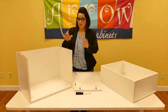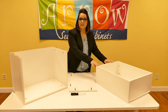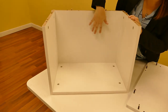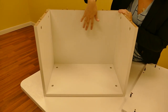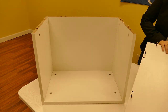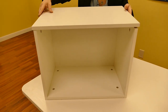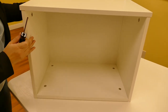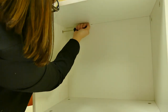In step 11 we are going to assemble the last of our drawers. Note that step 10 is the exact same drawer assembly, just with different panel names. Begin step 11 with the bottom drawer panel, attach the back panel, and connect the bolts to the side panels. Make sure that when attaching the bottom panel the smooth side is facing inward and the cams are facing at the bottom of the drawer. Once attached, take your top panel, align the cam bolts and the dowels, press those in, and make sure the cams are tightened on each side.